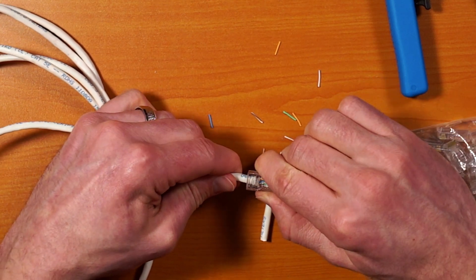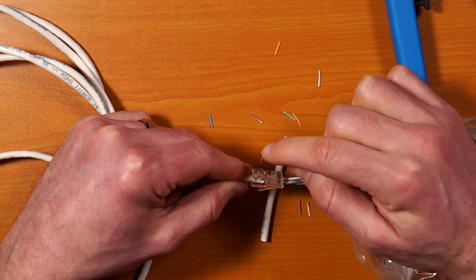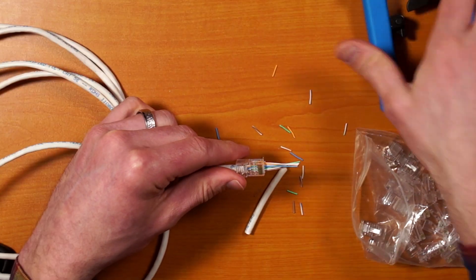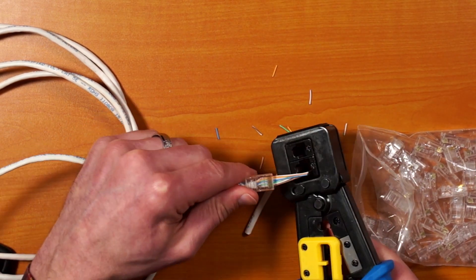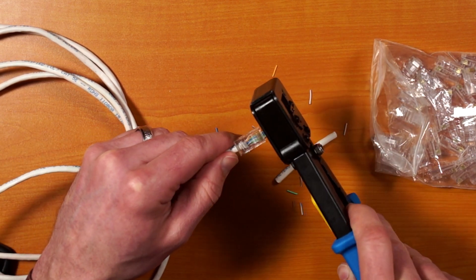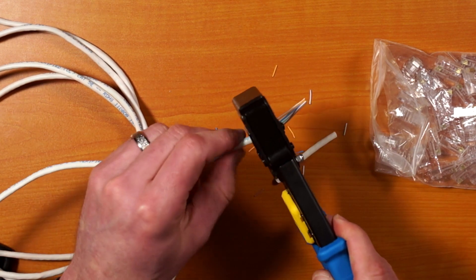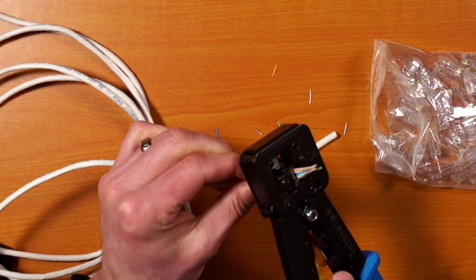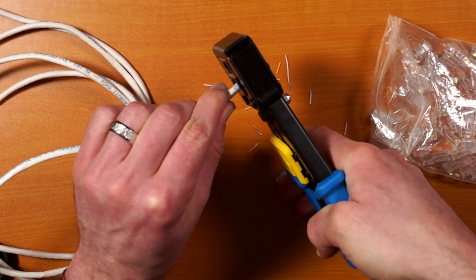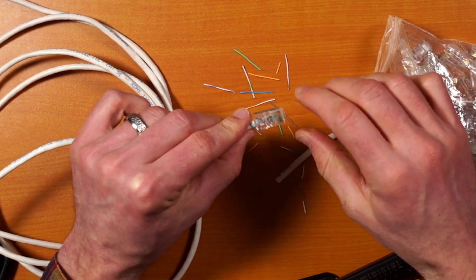Push this in as far as humanly possible. With Cat6, some people say not to shove it quite this far because it might pinch things, but on Cat5e cables since the diameter is a bit thinner, it's no problem. Get that good and solid in there. Then on the crimping tool, there's a slot on the back that says 8P — that's the one you want because there are eight pins. Slide the connector in there, make sure you don't get the cables caught as they go in. Push it in while you're going and then just clamp it down. The crimper cuts the end off those wires and gives you a nice clean connection.